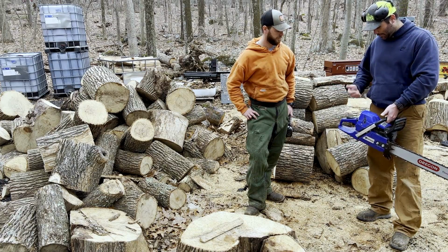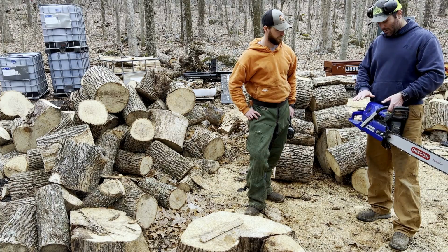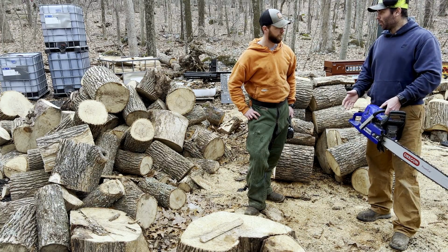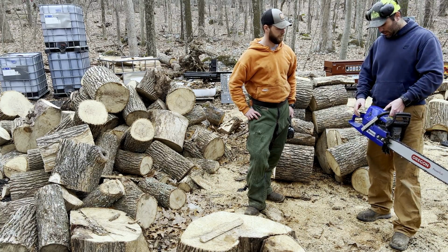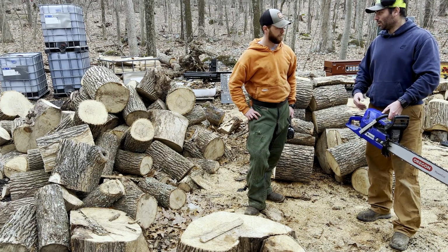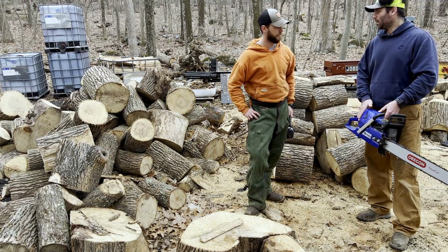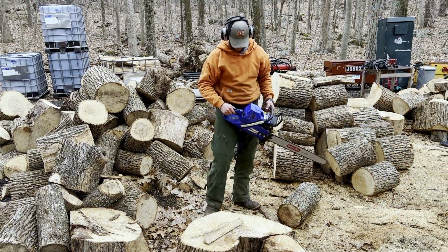It's essentially it. It operates the same way that any other chainsaw does. The only thing that I found with these, they might use a different carburetor than what Husky does because they flood very easily. So when you start it, you put it full choke. The first time it pops, you turn the choke off and you pull it, and it should fire right up. Cool.